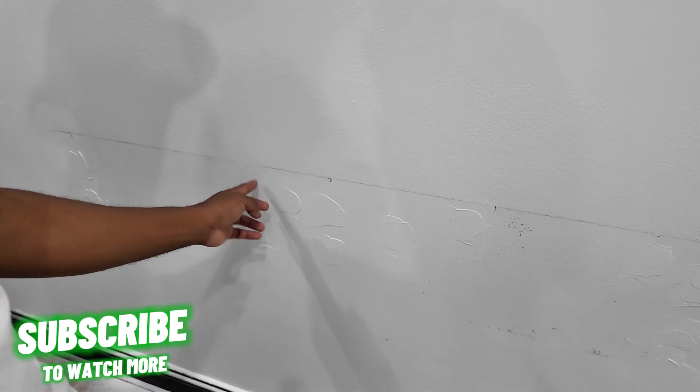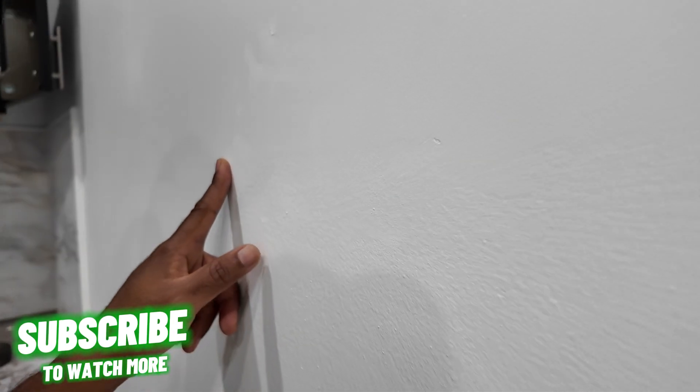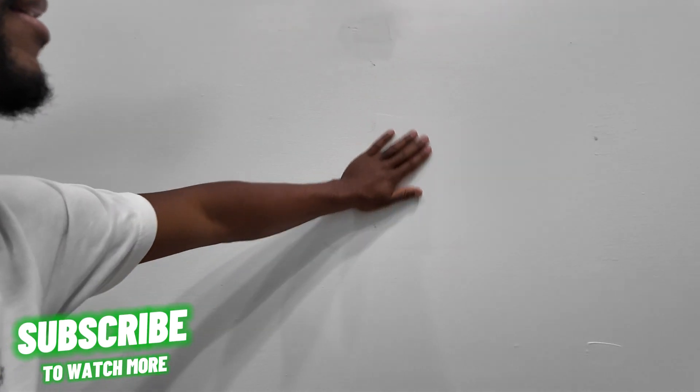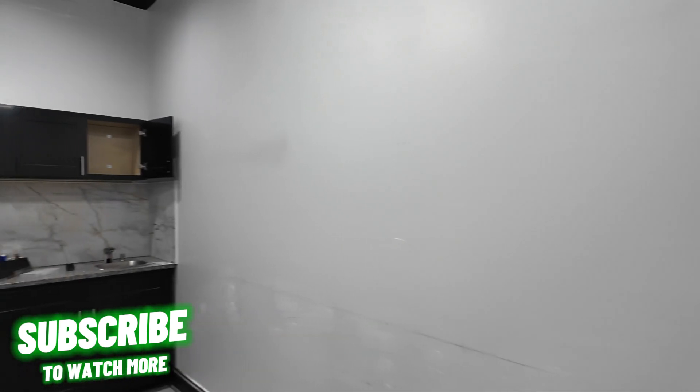It's gonna happen regardless because even now I'm patching stuff right here. What I try to do is smooth it out as best as I can and feather out the edges around the patch — that way when you're painting over it you don't really see the transition where the patch is. These previous patches, they didn't feather out the edges, so you can see the outline. However, because so much paint has been painted over this I can't feather it out anymore — you can't really sand the paint. Maybe I should put more compound over it and feather it out more, but you still end up seeing the patch. This whole room is just filled with huge square patches.